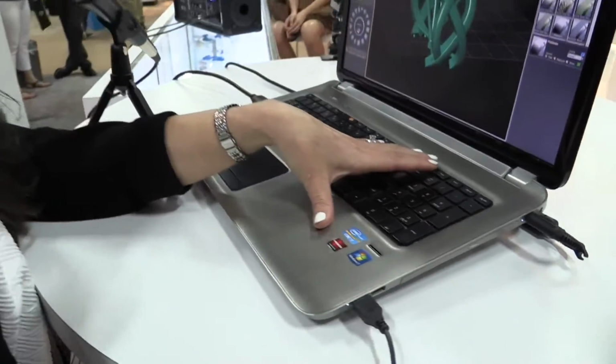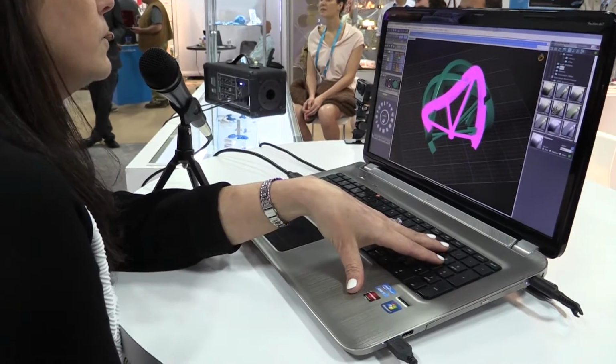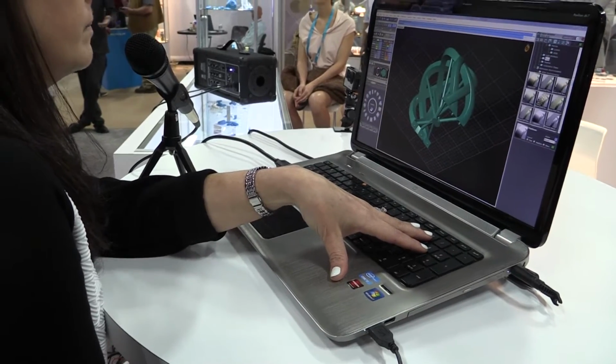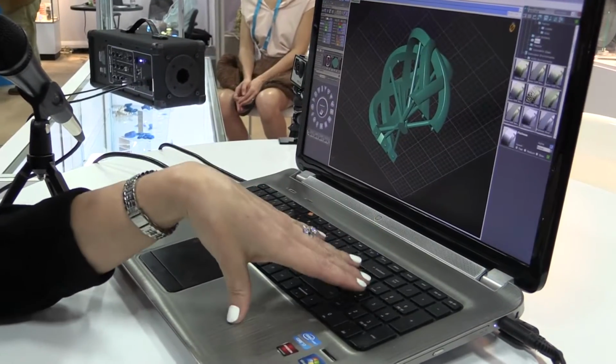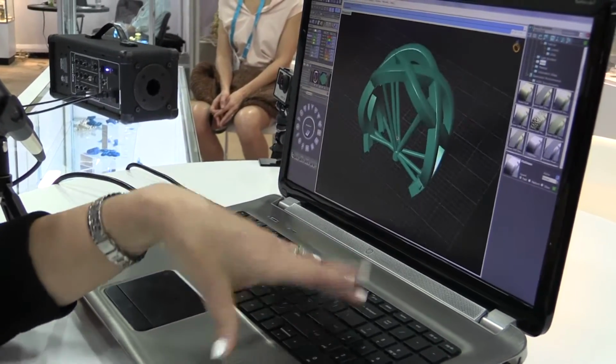One question someone had for me was, how do you know after you print it which piece is what? Because if you were to take this part off and make these all the same color and then cast them, which is which? What is going to identify this one as the rose gold and this one as the white gold? Within CAD, you can put a little square here, and that little square will say this is the one that's going to be yellow gold. You can put a little dot here, and those are things that are just removed during the finishing of the piece.